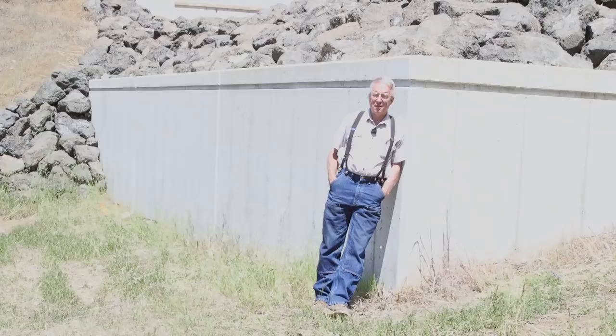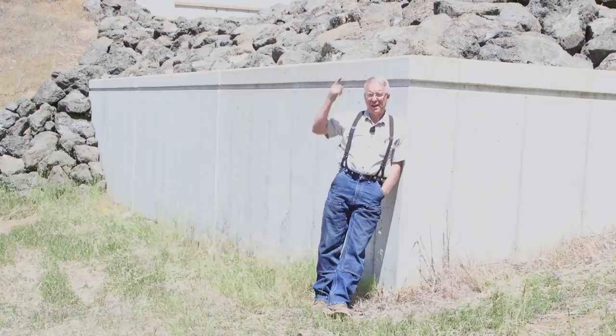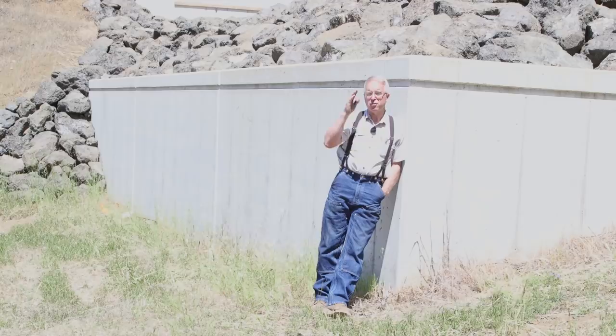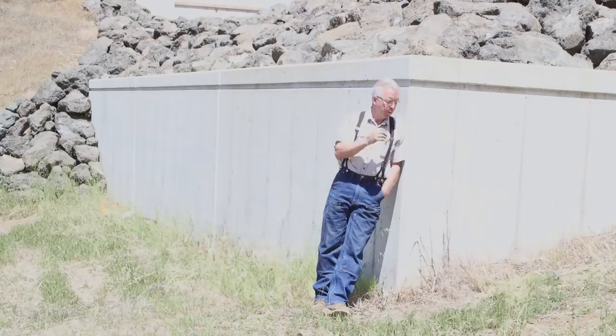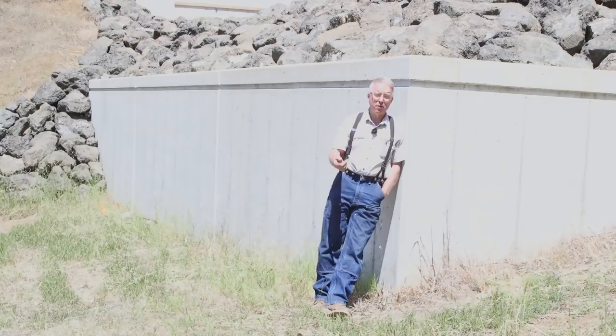The other mistake that was made — that you may have already recognized — is that I had to restack these rocks. You can see they're at a shallower angle. Because of a three-way miscommunication, it became obvious I needed to reduce the slope, the pitch on those rocks from where it was — and it was beautiful, Brian and the boys did a beautiful job. I needed to lay them back for two reasons: reduce the load on the wall, and reduce the fall hazard that many of you pointed out from living on the edge of about an 18-foot cliff.